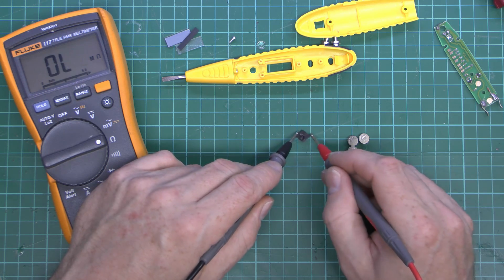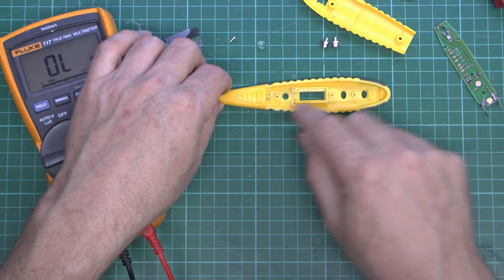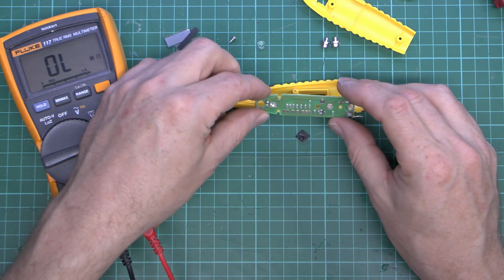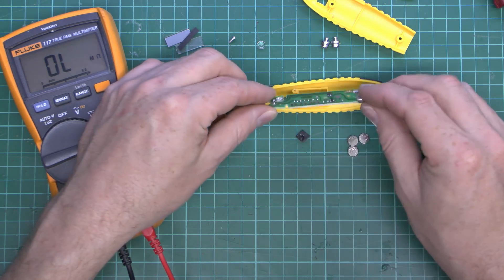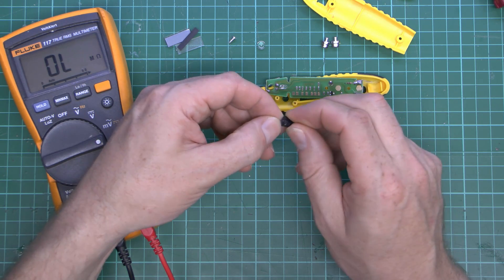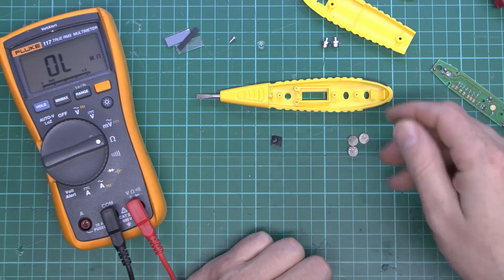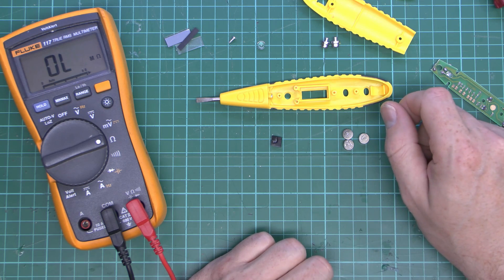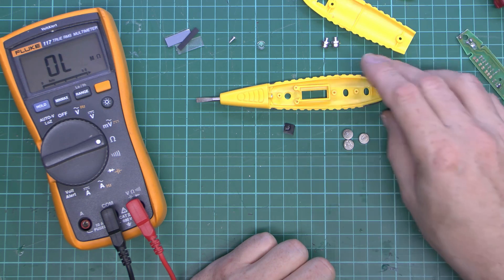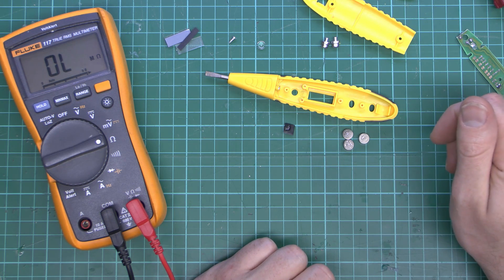Now it's not totally clear why they've used that, because the other one didn't actually have that — it just had a bit of wire stuffed onto that and had probably an extra resistor on the board. There's plenty of space on there to put extra resistors and we've already got the chain of them anyway. That may add a slight extra safety margin, but bearing in mind it's only a few k ohms, it's going to limit the current to a certain extent but it's still going to be a fairly unpleasant shock even in the 10k kind of area. So it may improve the safety slightly, but all the disadvantages of these things still apply whether it's safer or not.